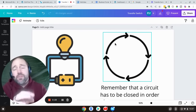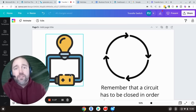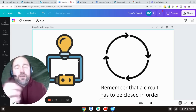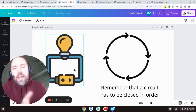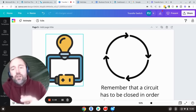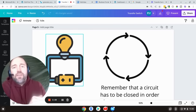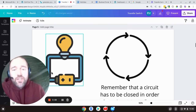Just to keep this in mind: electricity flows in a circuit or a circle. If you break that circle, basically electricity is backed up — it's got potential, it's waiting to go — but it can't do anything unless it can get back to the source. It leaves the source, goes through an appliance, does work, and comes back to the source. If you were to break this wire and touch one end of it, as long as you cannot complete the path, nothing's going to happen. But if you were to touch it with bare feet standing in a puddle, it could run through your body, through the water, and somehow make it back to the source — well, then you're going to get shocked.